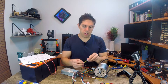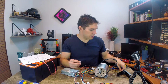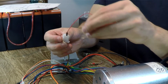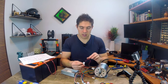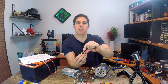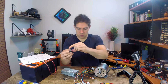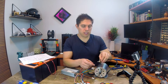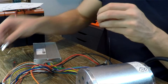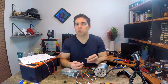The next connector is for the forward and reverse selector — it is gray, black, yellow. The middle black is a ground wire, and all we need to do is connect the middle to either side to select forward or reverse. In the final implementation I'm going to use a momentary switch, meaning as soon as you let go it springs back — so I can hold it down to reverse, and as soon as I let go it goes back into forward, preventing mistakes. I should have got one with three terminals, but for now I'll short it with a jumper wire and work out which side is forward and which is reverse when we power it on.